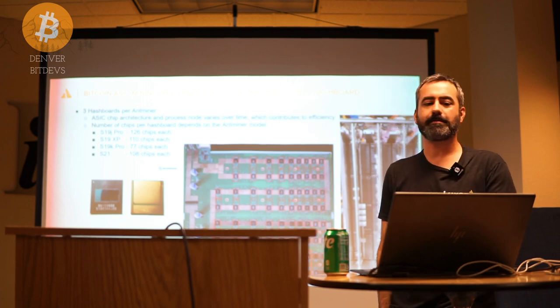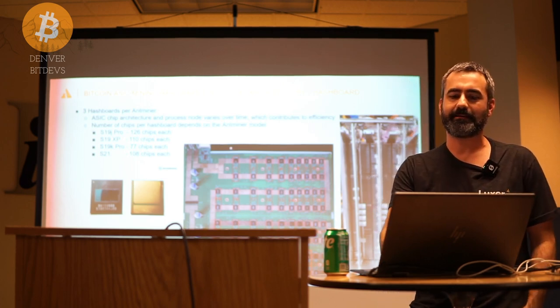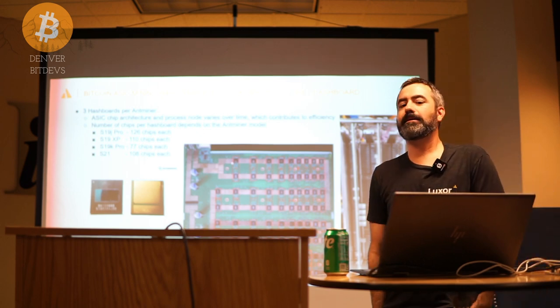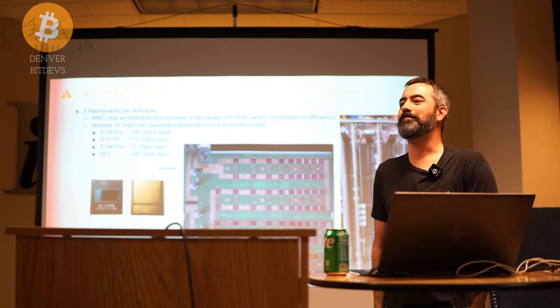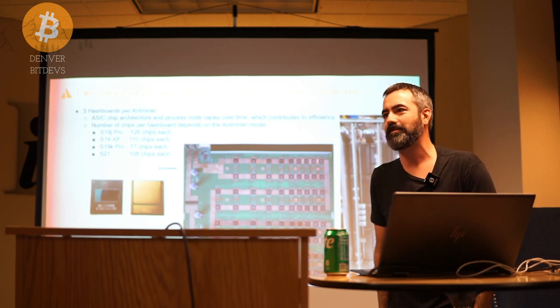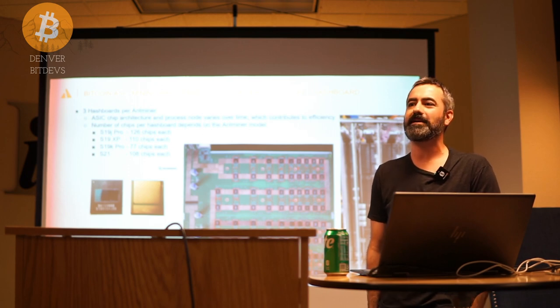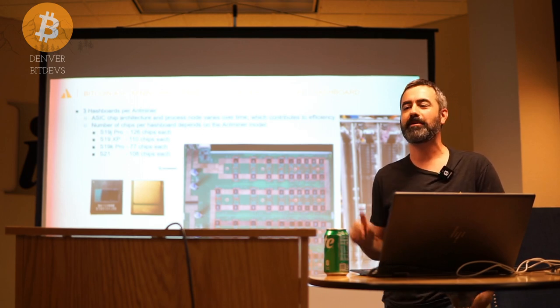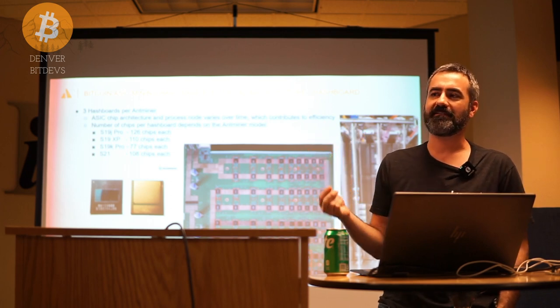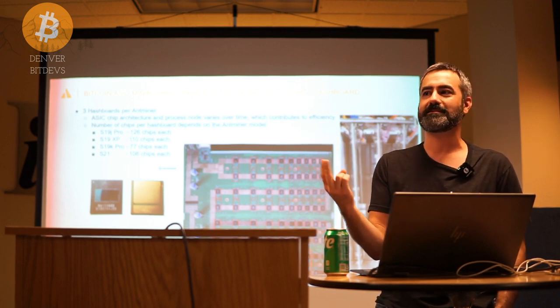Yeah, so you're talking about instead of putting the design into ASICs, mining with FPGAs? Yeah, I've been trying to figure that out. Yeah, so that was early on. I'm actually going to talk about that a little bit more, too. But the short answer is, yes, FPGAs were used, but they were quickly outpaced by ASICs for a lot of reasons, primary one being really two: cost and efficiency. FPGAs cost more. They're way less efficient.